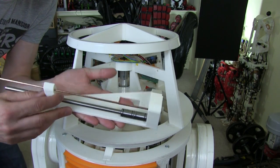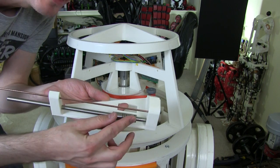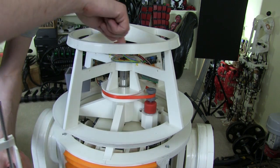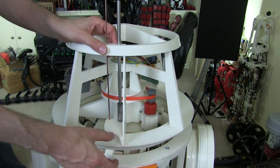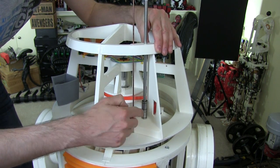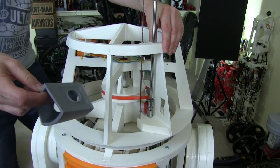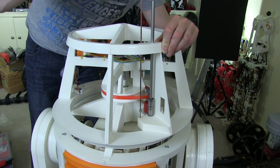Here's my printed piece of plastic with two bits of metal in - a 3mm steel rod and the 8mm steel with two linear bearings. On the bottom I've put a little ridge with the right contour to fit on the back of the head, and the inside slope fits quite nicely so this will fit in perfectly and be solvent welded. Then this will slide up and down and keep everything straight. Now I need to fit a servo in here, design a pulley that goes on it, and a pulley at the top so I can drive the carriage up and down.